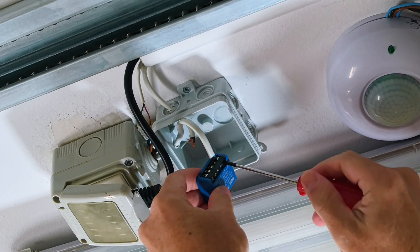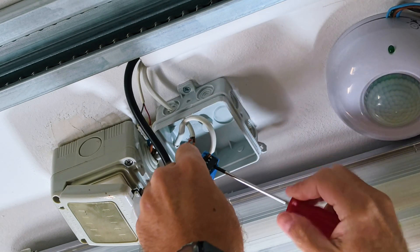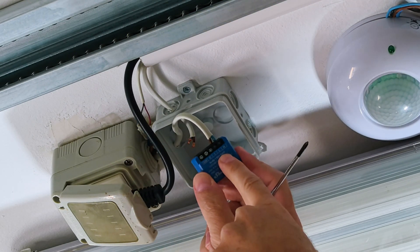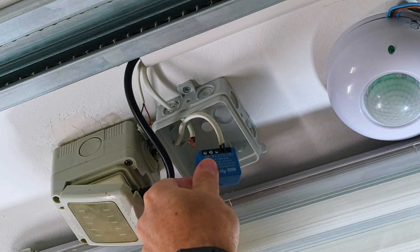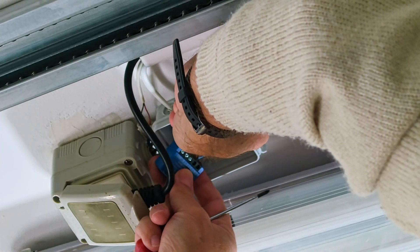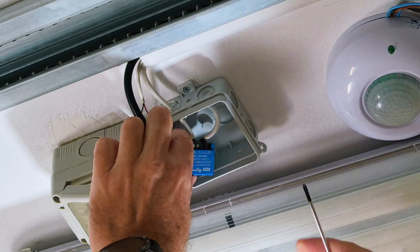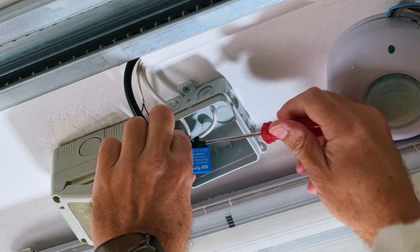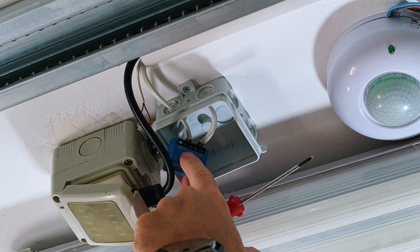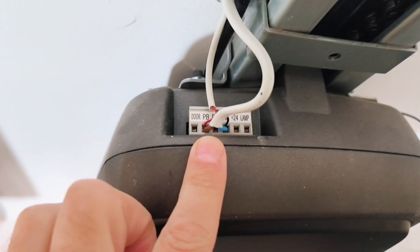In my case, you can see there's a small junction box near the power source where I got two wires, and I just need to connect those two wires to the Shelly One Mini where it says L for live and N for neutral — which is what's going to power the Shelly, in my particular case at 220 volts. Then I connect two more wires on the I and O terminals, which is a dry contact. We just put them in the screws and tighten well — that is it.